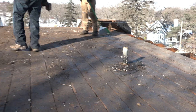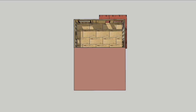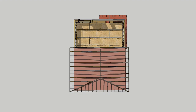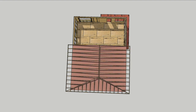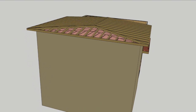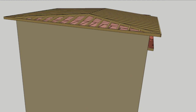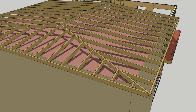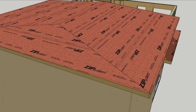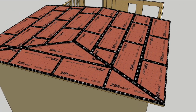With the old rubber and asphalt roofing stripped off the 102-year-old deck, the roof framing plan is set in motion. Steve will frame a simple, low-slope, hipped roof atop the existing one. The hip style with such a low slope will give the appearance of a flat roof when seen from the street. Over the framing is Zip System roof sheathing taped at the seams, which will complete the primary air barrier as well as sealing against water. Basically, after the roof is sheathed, it's also airtight and dried in.